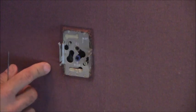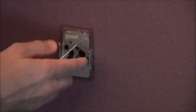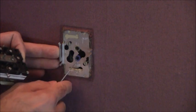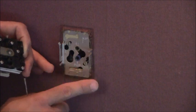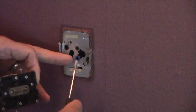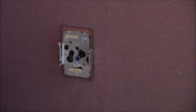The one on top is the branch going back to the actuator or velocity controller if you have it. The one on the bottom is the supply feeding the thermostat. I'm going to just put my finger over that — and it is still hissing. So what's happening is the leak is on this tubing right here. I'm going to open this up and take this apart right now.